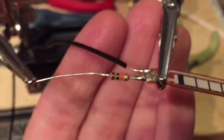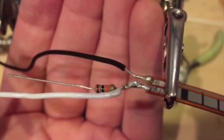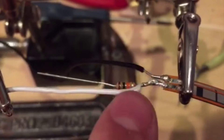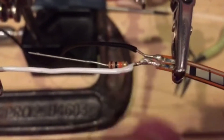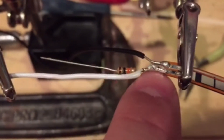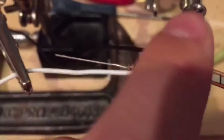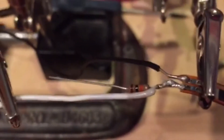The resistor and the white wire are on there. I had to re-solder some stuff — it wasn't sticking. The resistor kept falling off when I tried soldering the wire directly on, so what I did was twist the end of the resistor and the end of the wire together, then soldered that together and onto the lead. It worked a lot better — kind of sloppy looking, but it works and it's pretty sturdy.